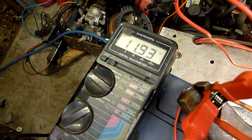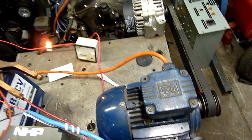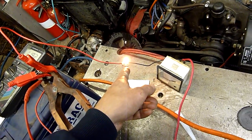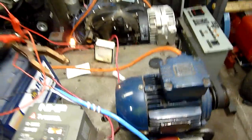It's currently pulled the battery down a bit — I've left it running. So let's see what this does when it comes up. Once the rotor gets to a certain speed, the excitation will occur and it will work. And that's what this lamp's for. You need to wire 12 volts through a 5 watt incandescent lamp to the exciter for it to energise. Some alternators are self-exciting but these ones aren't.